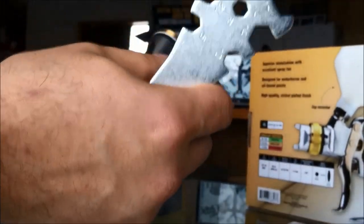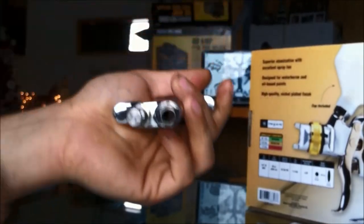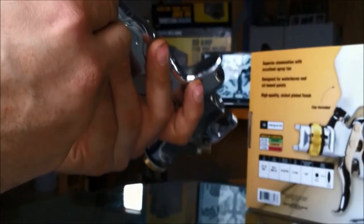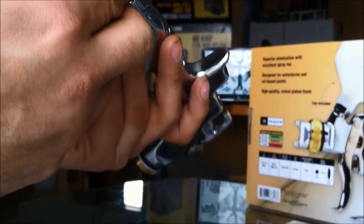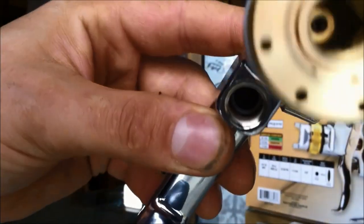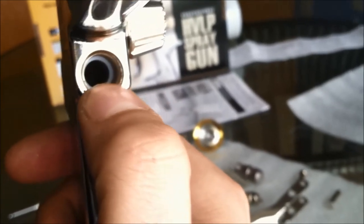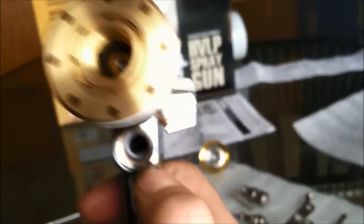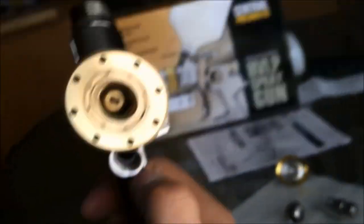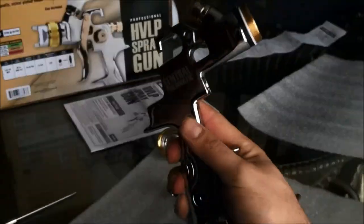There's the body of your gun. You can take the bottom valves off too if you want — the air valve and the adjustment valve — using the 14 millimeter. If you try to take it off it's pretty hard, so you'll probably want to use a line wrench. There's really no point in removing it; I just wanted to see inside to check for silicone. Looking down in there, it looks like they're using a nicer style — a white plastic or rubber O-ring for a seal. I don't see any caulking or anything down in there. For the money, I think we got a pretty decent gun.